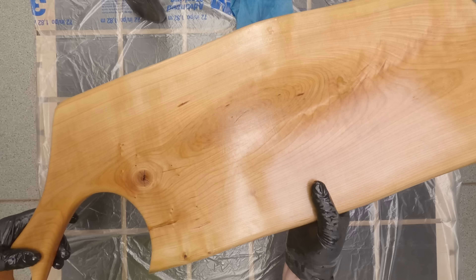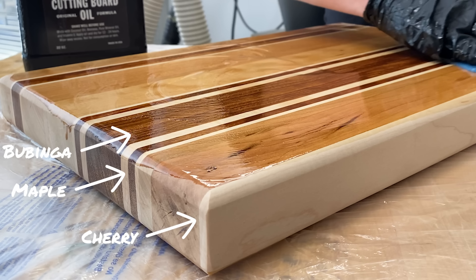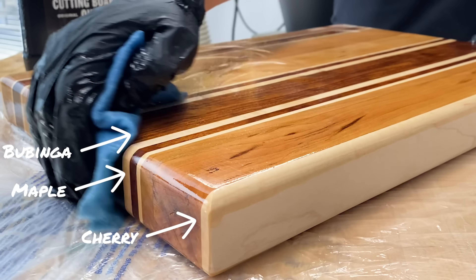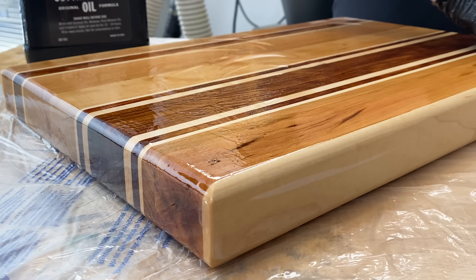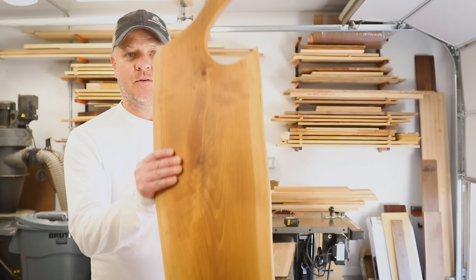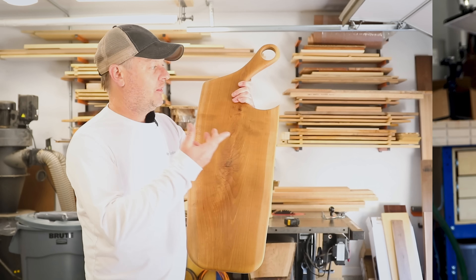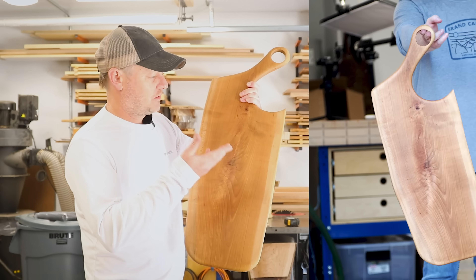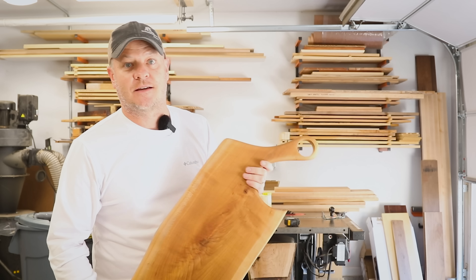If you're building a cutting board, just build your cutting board and finish it with a regular cutting board oil. It's going to come out about as dark as those first finishes did, and it will still darken up over time. This video took us maybe three or four weeks to assemble and edit, and that also gave this board some time to really darken up. Compare this to the way it looked just three weeks ago when I first applied that oil — you can see a huge difference now. That's the secret to cherry's color — it's just time.